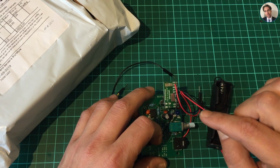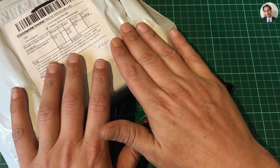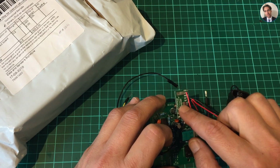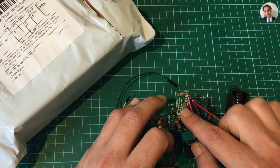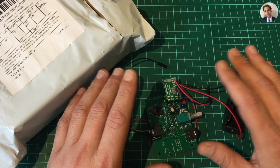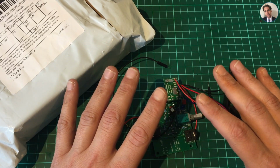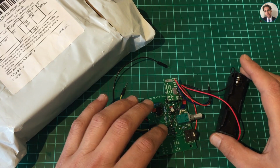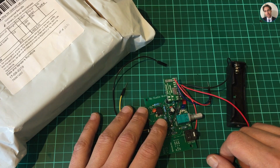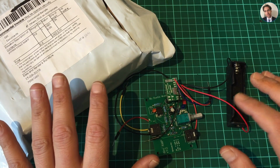The reason I am switching to a printed circuit board for testing is that I'm not sure if this is going to work. The inductor on this step-up converter makes some noise, and together with all these wires, it created some noise, which I at some point got rid of just by moving stuff around. But this is not a good test setup, so I decided to make a printed circuit board just for testing.